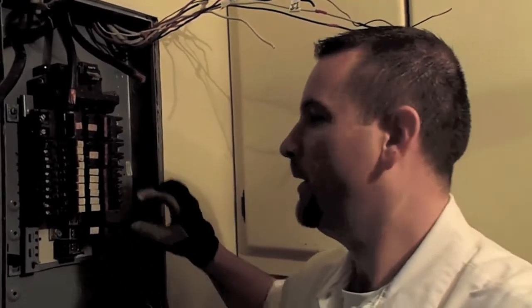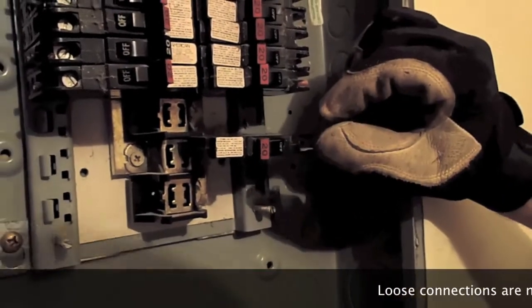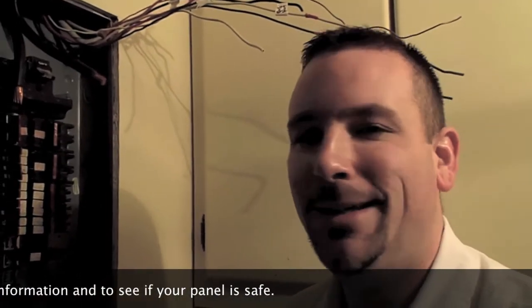We're here — we've got the panel chain pulled out, got the wires pulled out, getting ready to change out this old panel and put in the new panel. A couple of things I want to show you on these Federal Pacific panels — do a Google search for 'Federal Pacific hazard panels.' Some of the issues: these breakers have very loose connections. A lot of these older panels have an aluminum bus bar — this is the bus bar here that the breakers snap into. Aluminum bus bars just don't conduct electricity really well, don't last as well; just a very inferior product. So glad we're getting this changed out.